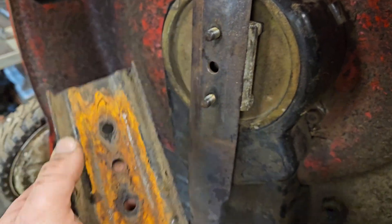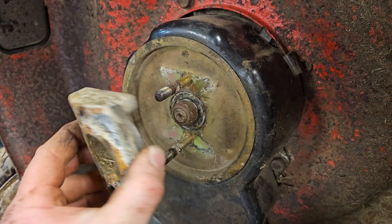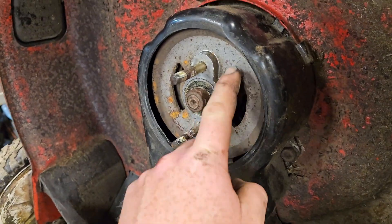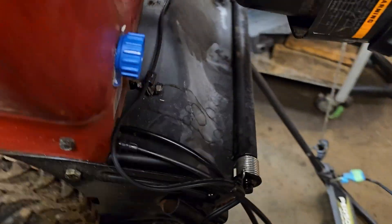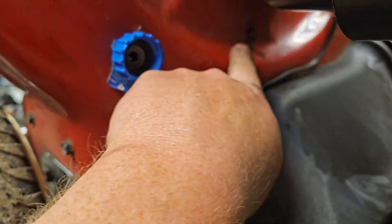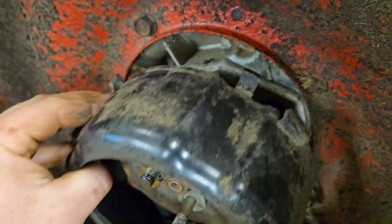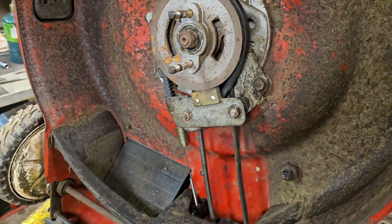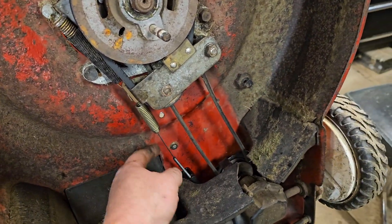You've got your blade cover — they call that the blade stiffener, whatever that thing's called. Here's the lower half of your clutch. There's a plastic cover over it with two bolts, one right there and one right there. You take those two bolts out and just pop this thing out like that, and that exposes your clutch system.